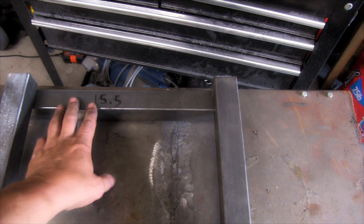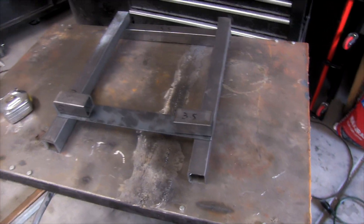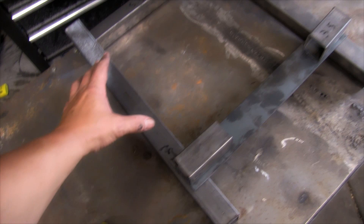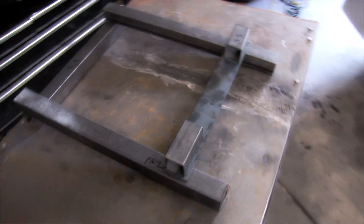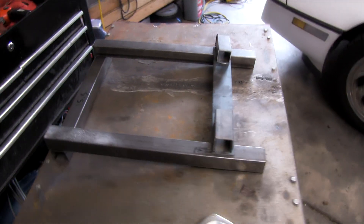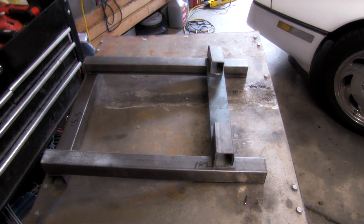Here are the basic pieces. I made them 15 inches but I believe I'll have to take this back one down — the whole thing needs to be 13 inches to fit the rails under the motorcycle. Before I cut anything off, I'm going to tack weld it and check my measurements under the bike. This piece goes under the back and supports the frame, staying out of the way of the kickstand switch. The front piece positions the motorcycle at the correct angle to bring it up straight and sturdy.